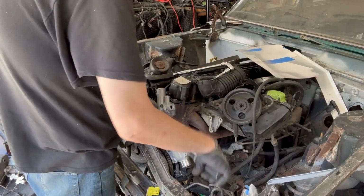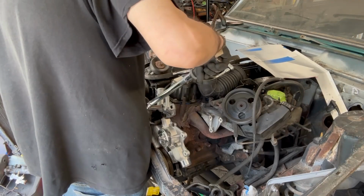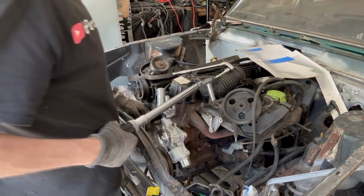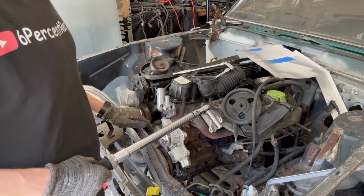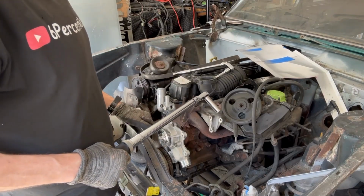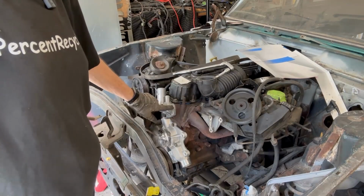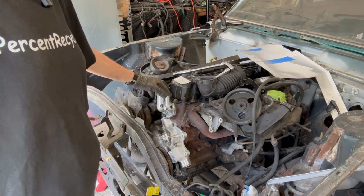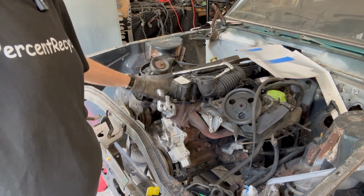I've waited an hour to let this stuff set up, so we're going to go ahead and torque everything down. I do have to start sealing on some of these fasteners, simply because one or two of them go into a water area, water jacket, whatever you'd like to call it. So I just put a little bit on all of them. I'm just not willing to take the risk. I'm going to go ahead and install the temp sensor now and cap off the inlets because I don't want anything getting into it. I still got more work to do before the hoses go onto it.